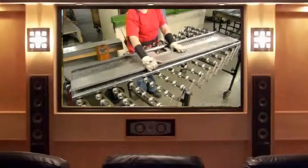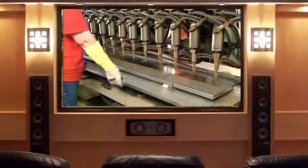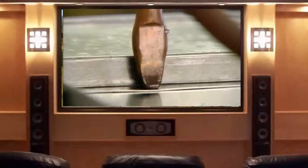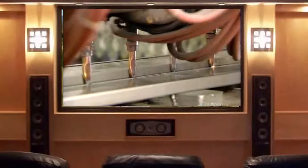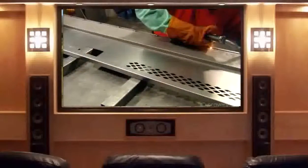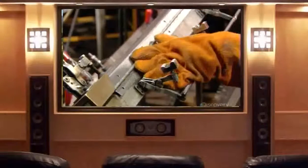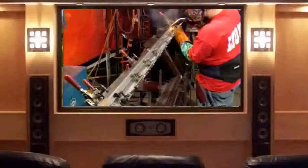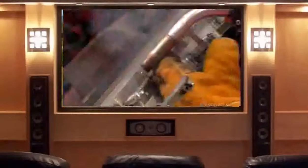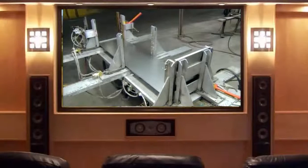Workers position a steel reinforcement panel against the hinge side of the door and affix one side using a welding machine that fuses 12 spots simultaneously, then weld the other side manually. They mount the door in an alignment fixture, hinge side up, and clamp a piano hinge to the edge, fusing it to the door by welding it to the top row of screw holes. Meanwhile, they've bent pieces of steel to form the locker's top, bottom, back, and sides.